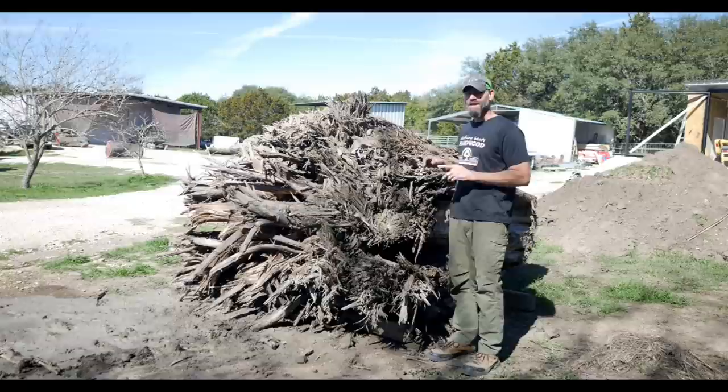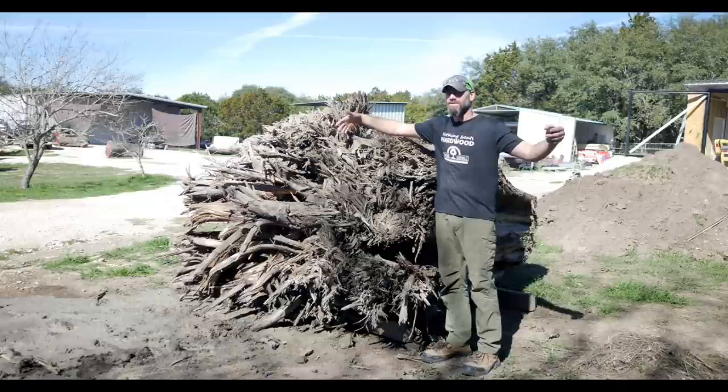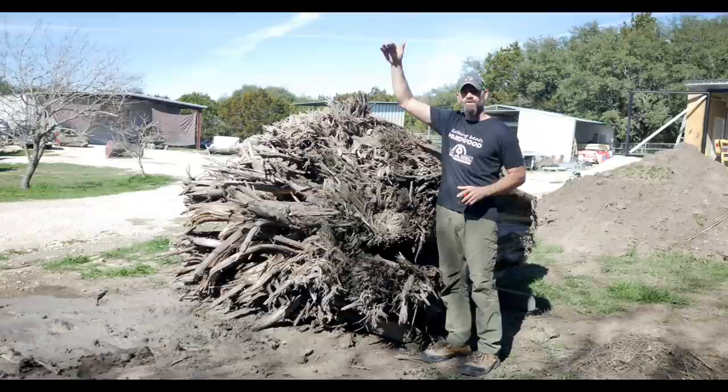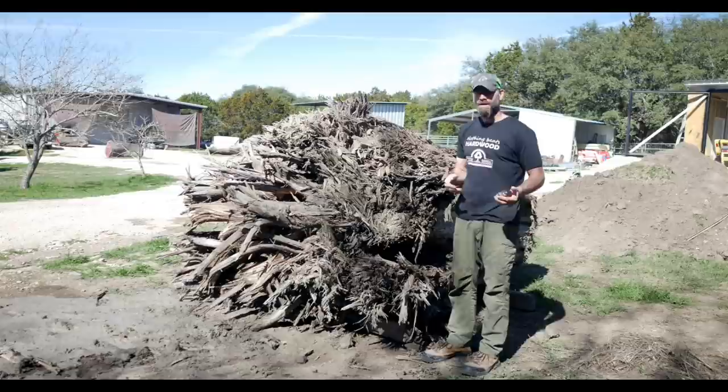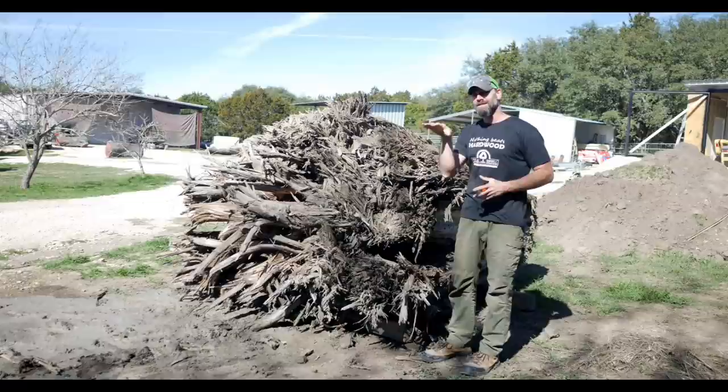So this stump is definitely far too big to put on our sawmill without trimming it down to safely sawmill it. So we're gonna cut it down on the width to somewhere under 70 inches. Now, what I wanna do in an optimal scenario is maximize the height of the log on our sawmill so I can get more cuts or more lumber or more slabs for the client. So I think it's somewhere over 80 inches right now. I'm 6'5", and it's pretty close to me on this side. So let's look at some measurements and some areas also that it's gonna sit flat and be well supported on the cants of the sawmill.